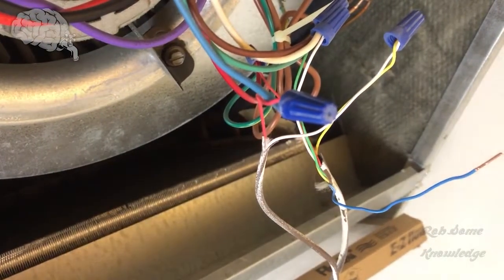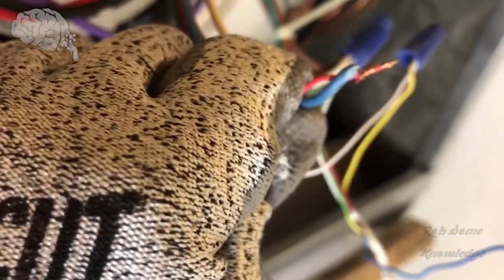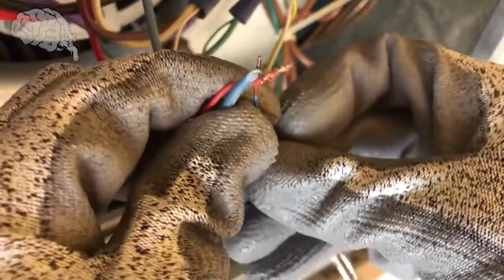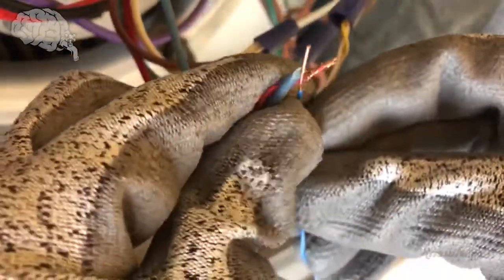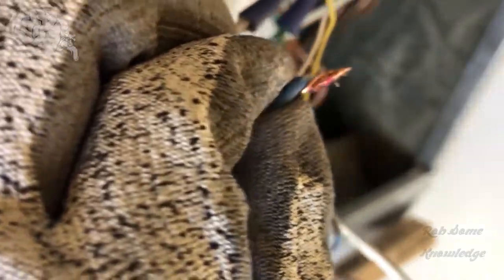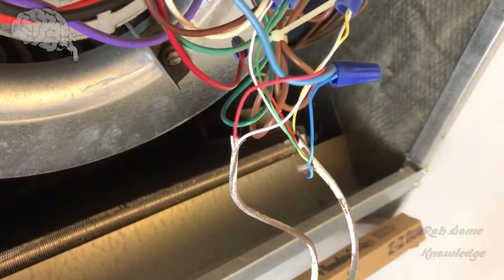So with all power off, make sure you don't lose your wire nut. The C wire is a thick wire compared to this little red one, but we're going to put it in here with these other two, twist them together, and then go ahead and put your wire nut on there nice and snug to make sure that's a good connection.